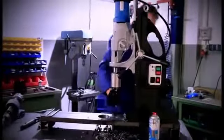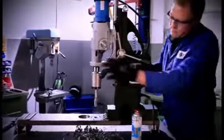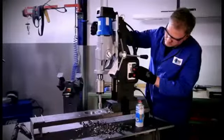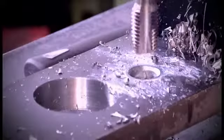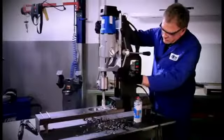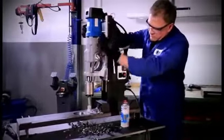Rotate it so that the catch mechanism snaps into the proper position. Tapping is made at low speed. Consistently move the machine slide downward after the tap has been sprayed with lubricant spray. The tap automatically draws itself into the material and you just have to follow with the machine slide by applying light pressure.